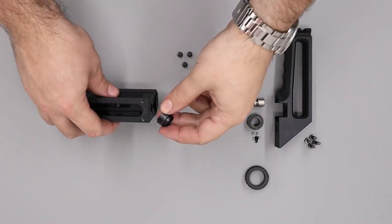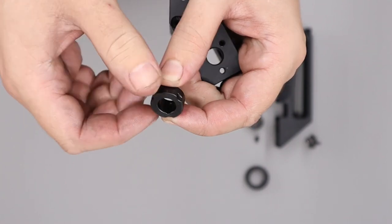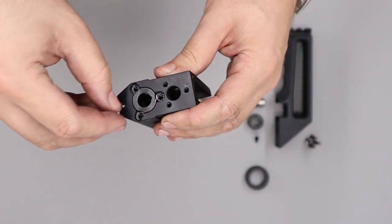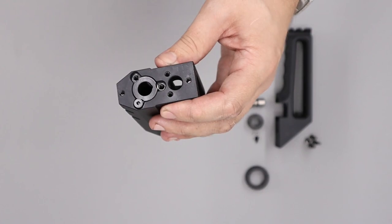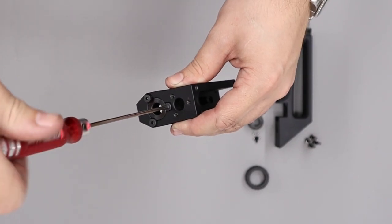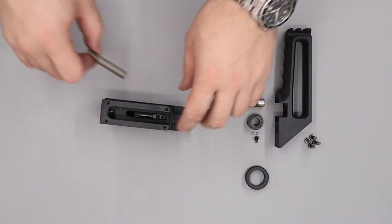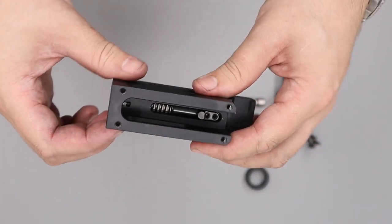Install the bush into the back, making sure the small slot in the top is aligned with the top of the block. Get the three securing screws started — get all three started before doing any one up tight — and tighten them with a 2.5mm allen key. Then take the hammer spring and drop it into the back of the block, making sure it's lined up with the hammer and flows into the back of it.